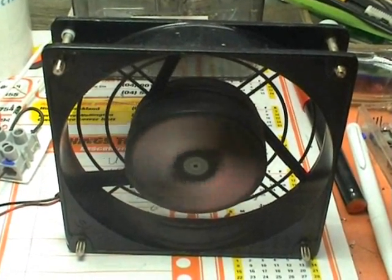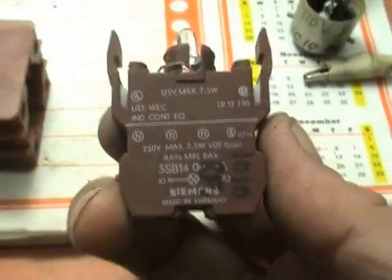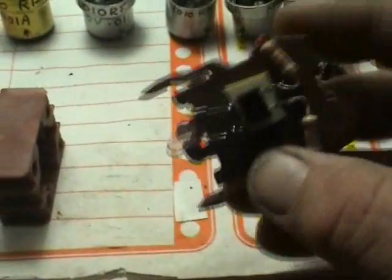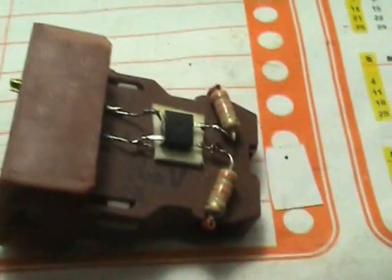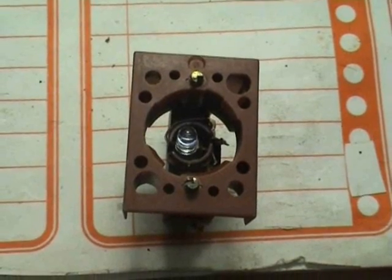The 24-volt fan running at 10 volts. It's a standard Siemens type fitting but I've modified it for 240 volts with 33k resistors into the terminals, and a little rectifier and a blue LED. This unit clicks into place here. The LED is in the focal point so it gives a good output to the lens.